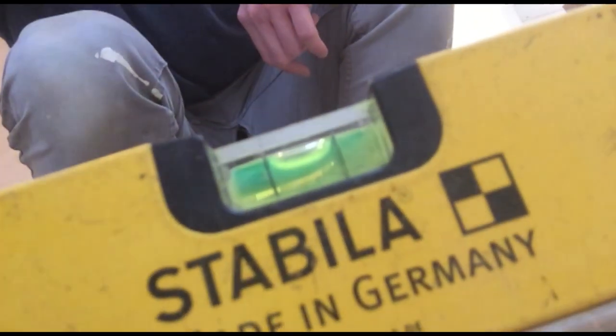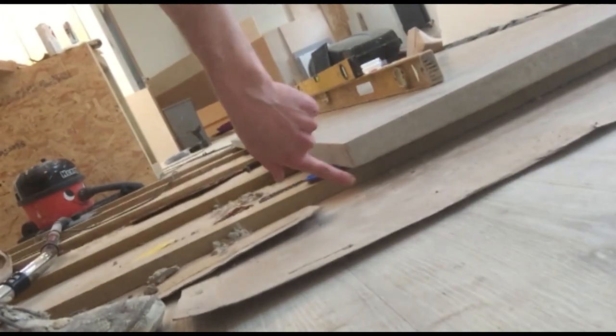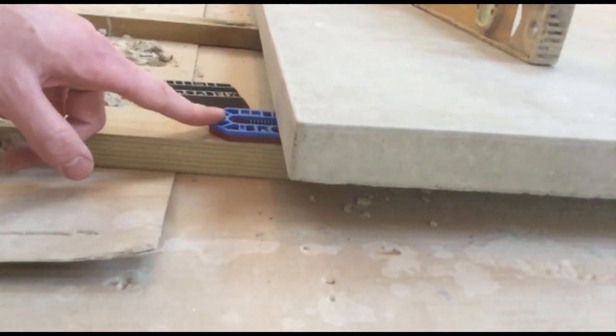I've got the surface completely level — I've got a nice big level here. Make sure the surface is completely level because I've got a self-leveling epoxy. I'll put a link in the description afterwards; I'm not affiliated with the products at all, just my recommendation. You want to make sure it's completely level in both directions. I've got batons running across the floor so I can get my fingers underneath and scrape under the edge to get drips off before they set. I've also got shims to make the concrete level because my flooring isn't completely level across the room.